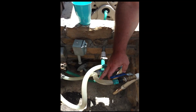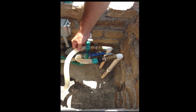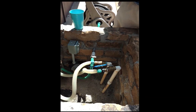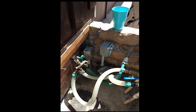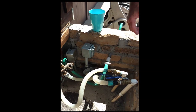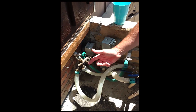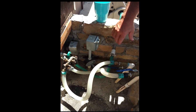These are fairly new hoses. I use reinforced fiberglass hoses because there's a lot of pressure on them. I leave this one on, this one's off but it still has water — I don't shut them off here, I shut them off up there. Keep an eye on them; I have replaced them, but not very often. If it starts really bulging, you replace it — no biggie. If you want to shut everything off, shut that off. You can shut them off here to leave the others on and do maintenance on this side. I don't turn it all the way up — you don't need full pressure, and that helps save on the pressure for these.